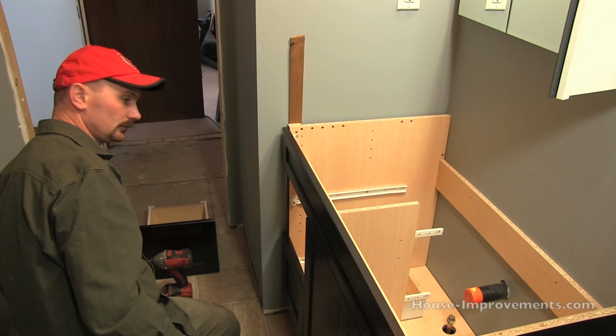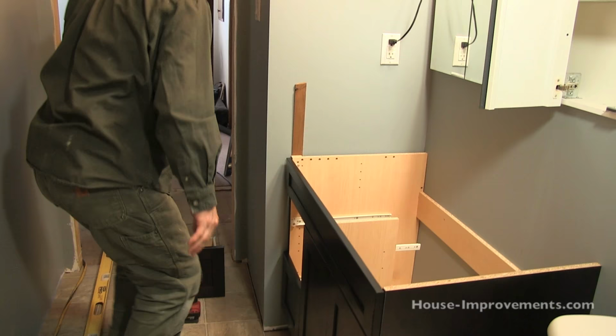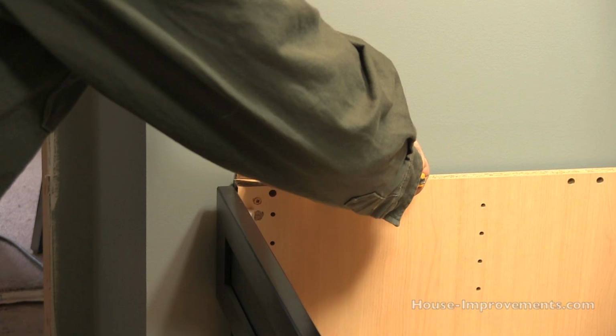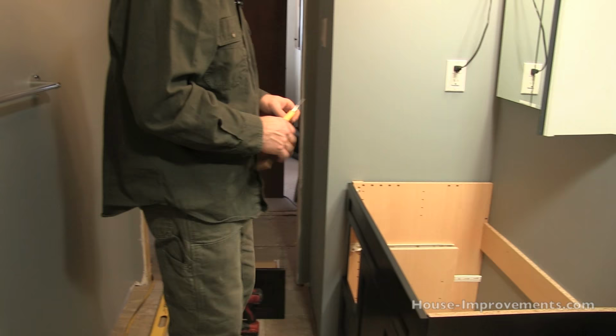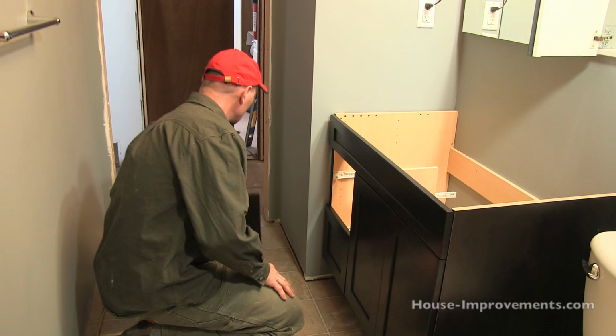Now you could put another one in there down further if you wanted to. Now for that shim, if I had my darn knife with me, and you've probably seen me do this before using shims somewhere else, if I just cut right along the top of the cabinet a few times, try not to slip and cut the wall. Now I can break that off. It's a nice clean finish. The countertop will go on there. And like I said, the little bit of a space I have there, I'll use some latex caulking to caulk that and then just cut the paint color back into it. So we should be good there. Stick this drawer back in.